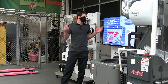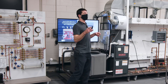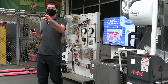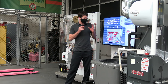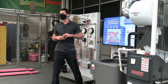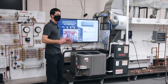If you didn't have insulation and the line set was traveling through the inside of the building, what would happen? When you take readings, you wouldn't know the right amount of superheat that you have, because you're absorbing heat from the outside. Both lines are going to be low in temperature, and they're going to attract humidity. It's going to condense on the tubing and drip down, causing sweating and ruining the building.